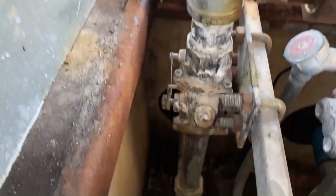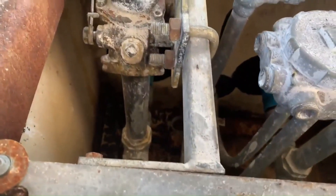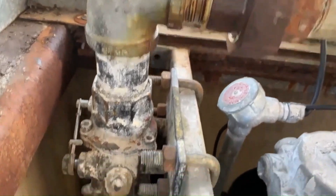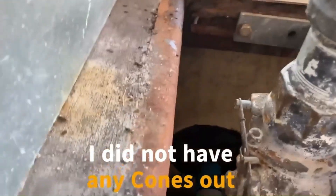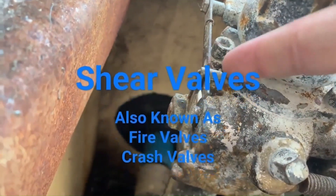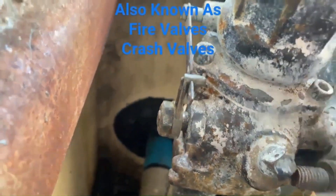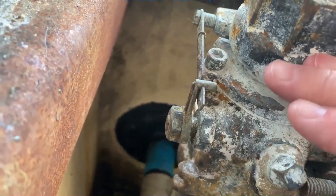The first thing you'll notice is the shear valves. The shear valves should be anchored to the concrete so that they don't move. If you ever have an incident and need to shut off fuel, right here is the easiest way to do it — you just reach in, pop that piece up, and the whole thing will shut off. There's a butterfly valve in there that shuts off the flow of fuel.